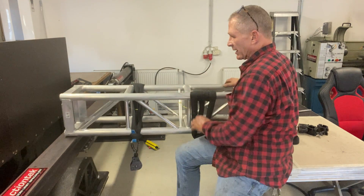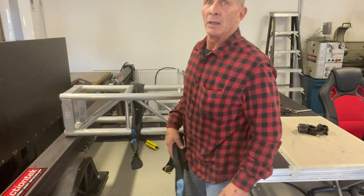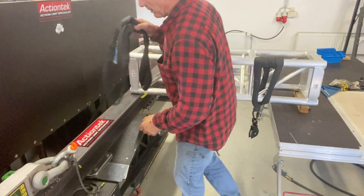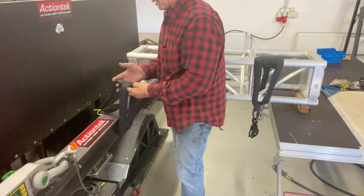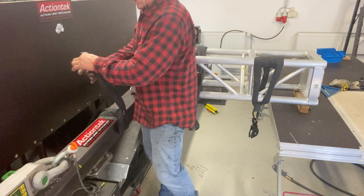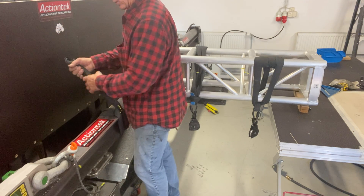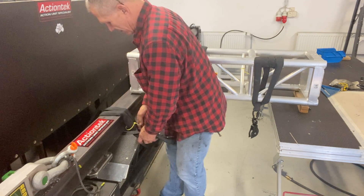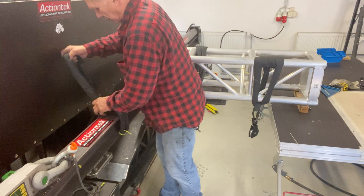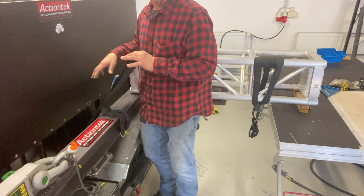So that's the important part to remember. The saying goes, if you want to use these on a beam — if my load is going that direction, I'm back choked here so the force is going this direction. If I was to do it the other way, you'll notice that it's pulling back and the force is going this direction.